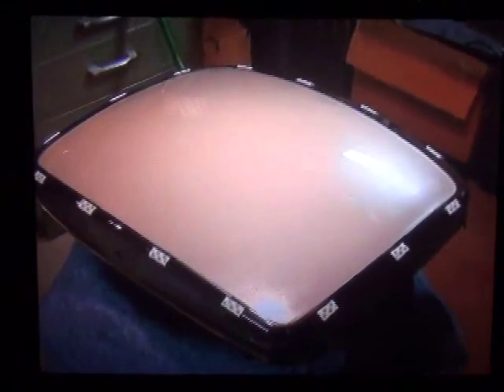The double-sided foam tape has been installed around the perimeter of the CRT. I use 3M number 110 double-sided foam tape, which is half-inch wide and about an eighth-inch thick. I cut the pieces into about one-inch long strips. It's critical that you place these strips far away from the edge of the phosphor — we don't want to see these foam tape strips on the edge when we reinstall the CRT. It doesn't look good.